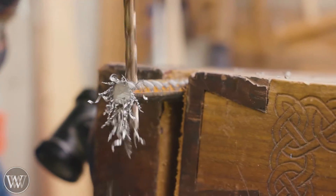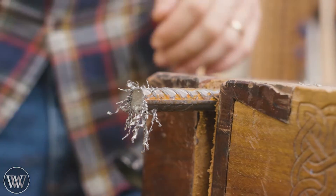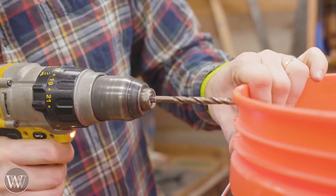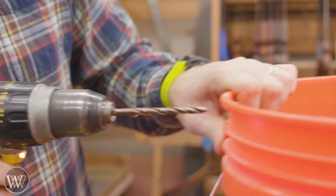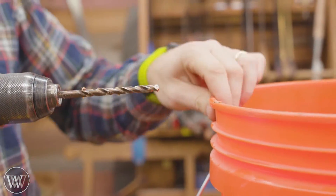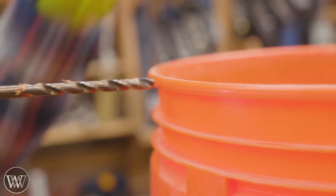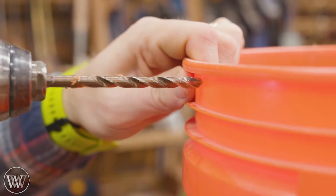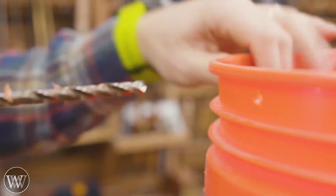So if you can drill some holes through rebar, you can make an electrolysis bucket. With all that cleaned off, we can put these into the bucket, drill the holes through the bucket, and I'm just going to evenly space them around the inside of the bucket. There's nothing special about them as long as there are enough places for the positive anodes to connect.